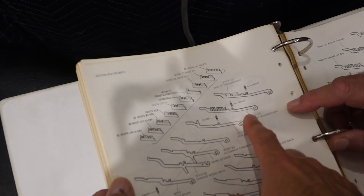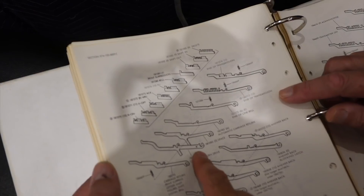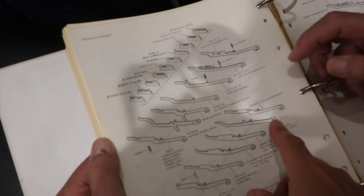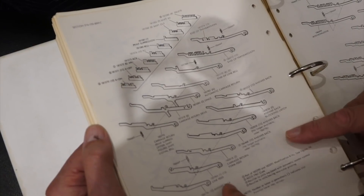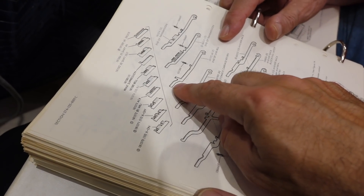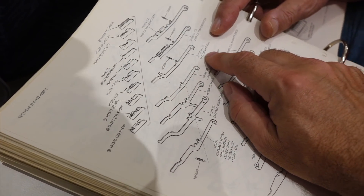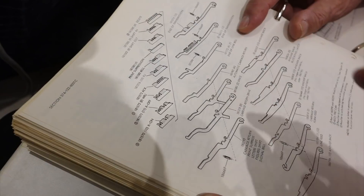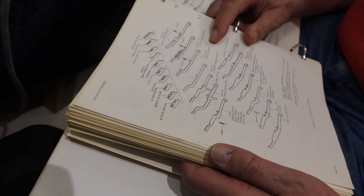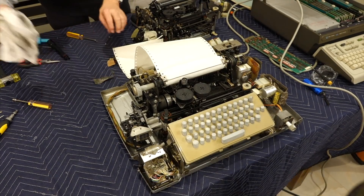So I had an end-of-transmission lever that was wrong because it's got adjustment slots in it. And maybe a carriage return — there's carriage return. Oh, there's so many of them! And the other lever that wasn't engaged right was the end-of-line bell. So none of those are going to help us with line feed. So the function levers definitely were not where they belonged.